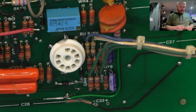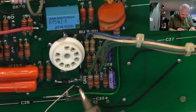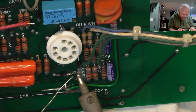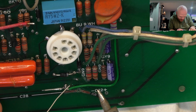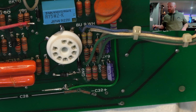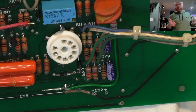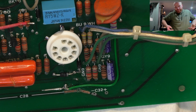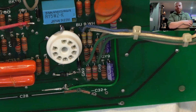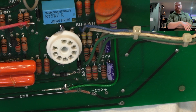Alright, champions, so I've just reverted back to the original circuit here and hoping that's going to be hunky-dory. Reverse engineering the thinking here, I think the reason that they piggybacked the caps and did all sorts of shit is just because the original one failed and it was standing up on end and they were afraid to remove the board because they're sane, unlike me. So they just piggybacked other caps over it and left the failed one in place, which is shit, but I reckon there was probably nothing wrong with the original circuit.